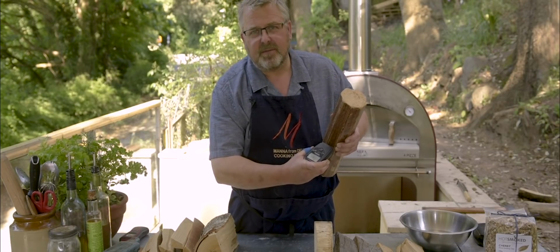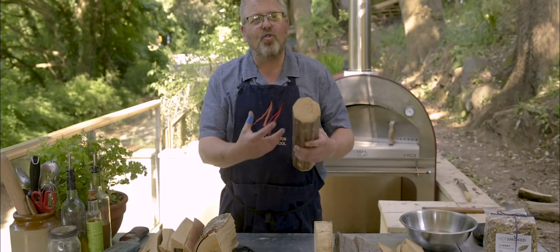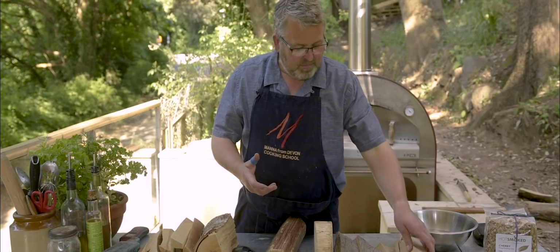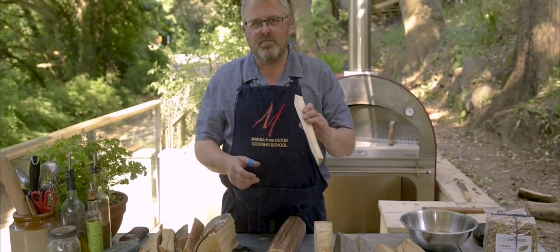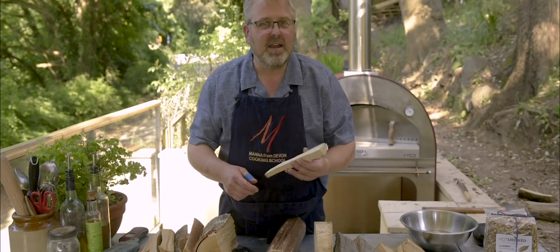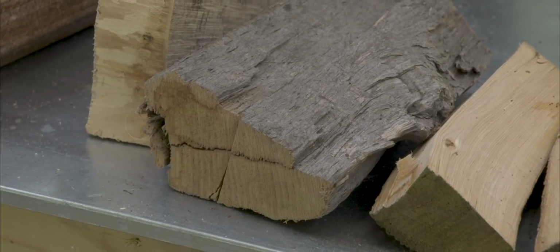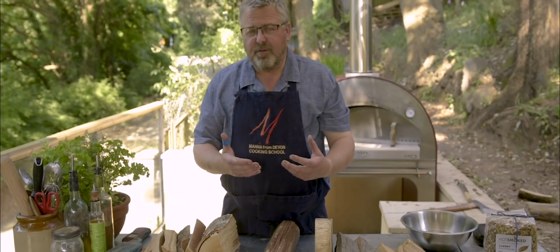The outside there is at 7.5%. Wood is hygroscopic, so it will absorb moisture. So initially it dries out, but then, beyond a certain point, it becomes hygroscopic. So this stuff comes out of the kiln, lovely and dry, but if it's sat outside in our atmosphere, we just have wood at sort of 16 or 17% after a few months, because it would soak it back up.